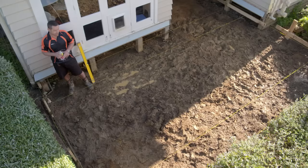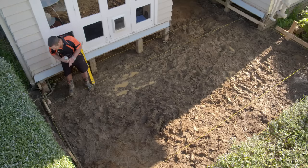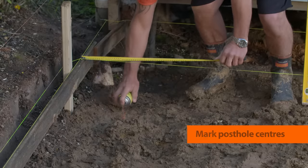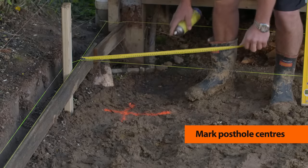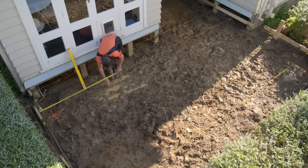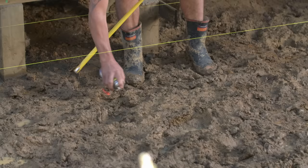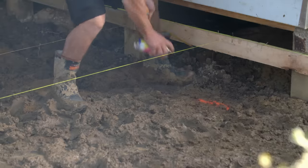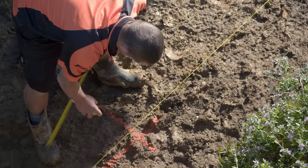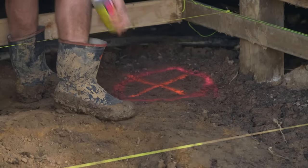All my string lines are up. Next I have to start marking out exactly where our post holes are, as per the dimensions on our plan. The first one is 200 millimeters from the outside of our building line. Then our next centre is 1298mm — so we add that to our 200, that's 1498mm. And 1298mm to the centre of the next two, then 200 millimeters from the outside to the centre of the end post. As per our plan, I've got four anchor piles, so I'm going to label those on the floor now because they go 900 millimeters deep.